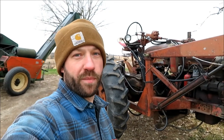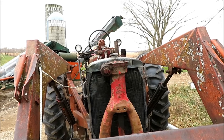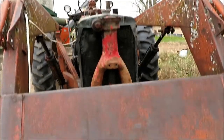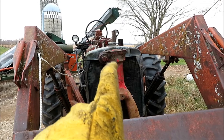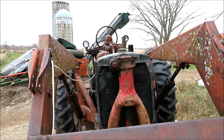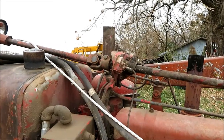Little fixes here on the farm this morning. We finished tuning up the picker last night, and now just a couple of things on tractors that needed to be done. On the Farmall M here, I've got the hood off. The steering was particularly loose — going down the road with this thing is like taking your life into your hands, the front wheels would go kind of crazy on you. I took the front bolster cap off and checked the worm gear, tightened up the castle nut on that a little bit. That helped some, but the main problem was in the linkage where the two different shafts join each other — there was quite a bit of play there, so I tightened that up.